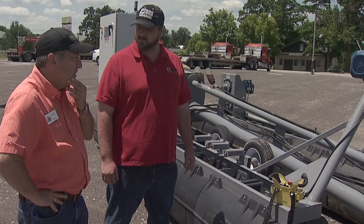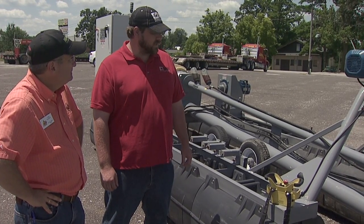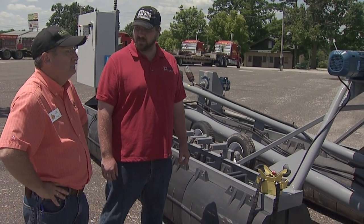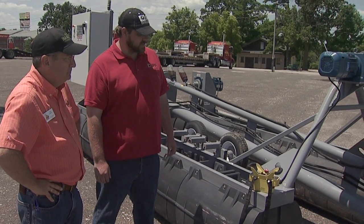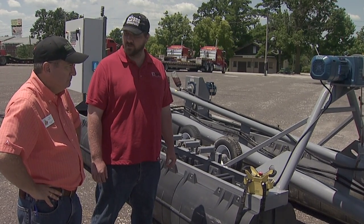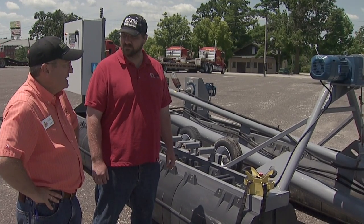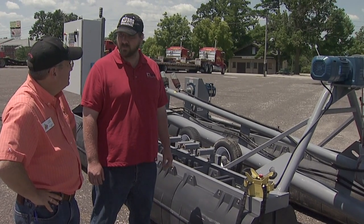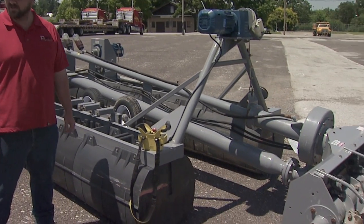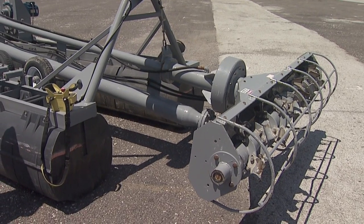How about if you were going further away with a booster pump? What's the most you can pump? We do make larger units capable of pumping up to a mile away directly off the unit. We also know of projects where people have pumped as far as two to three miles away using a series of booster pumps. This unit at its maximum production can produce about 1,100 gallons per minute if you're pumping directly to a booster pump on shore.